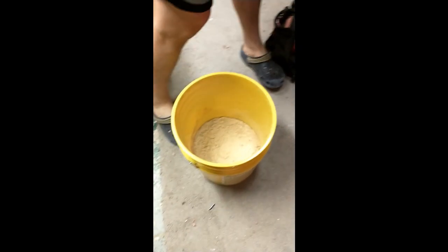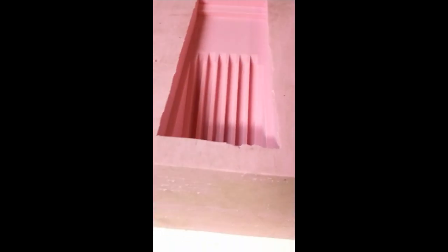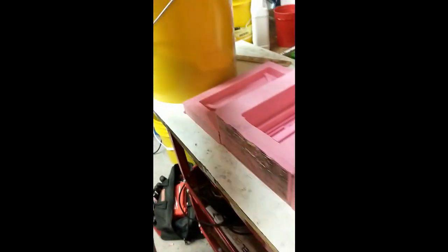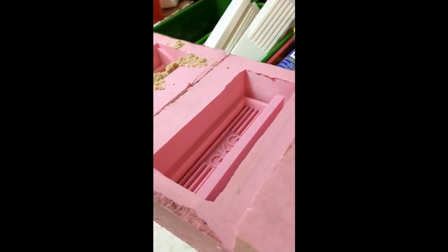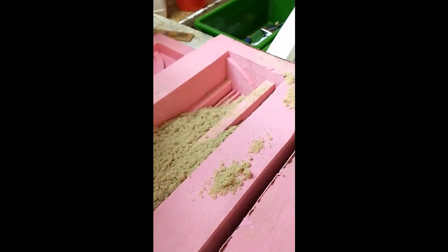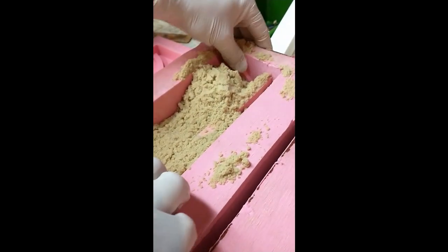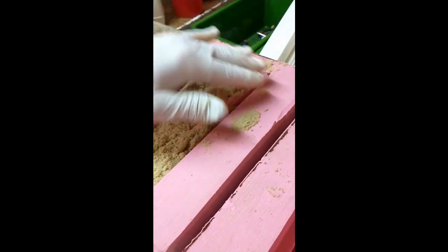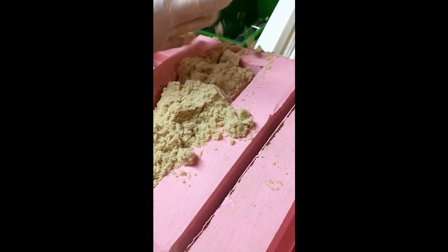The next thing we do — some of these molds are very flexible, so you have to be very careful when you're putting the sand in. It's better to drop the sand in and let it set versus trying to pack it in. You can do a shake-pound like that — works best. Before you mixed it, it looked a lot like oatmeal — yeah, there were chunks.